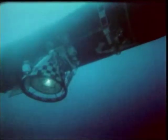Now, the rescuees are loaded on board. 24 rescuees are carried each trip. Normally, 6 trips evacuate a nuclear submarine. Separating is essentially the reverse of mating. Upon return to the mother sub, if the rescuees require decompression, the DSRV is mated athwartships to the forward hatch to offload rescuees into pressurized compartments, then moves to the aft hatch for replenishment.